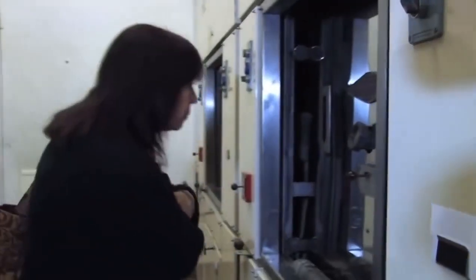Reach up to 1130 degrees while the cremation is going on, depending on the size of the body and what it's got to cremate basically. The gas usage is minimal. We might have to use the gas burner for the last 10 minutes of the cremation. Throughout the majority of the process, it's just forced air into the chamber. There's already the heat that's built up, and then you've got the material, which is the coffin and the body. So that forms your triangle to create fire, and that will generate the cremation, all right?